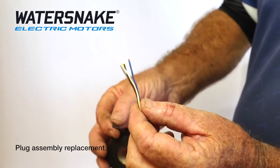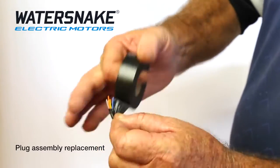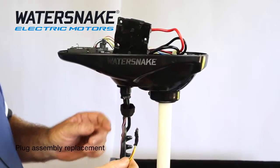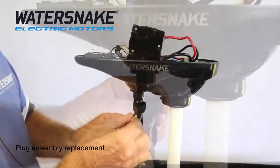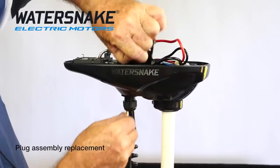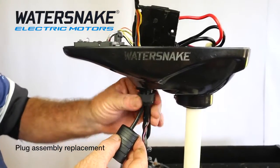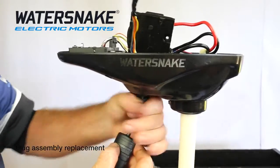We're going to take the ends of our 6 wires, wrap a little bit of insulation tape around the end, and you only need a couple of turns like that, and then just break it off. We've taped the end so it's easy to poke through, making sure we've gone through the nut. Just poke it up and keep pushing, up into your head unit, and it will emerge out of our head unit. You may have to use a pair of pliers to grab it. Leave it till about 2 inches, and if you tighten up the nut now, you won't forget to do it later. It's only thumb tight.